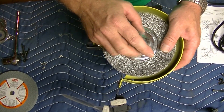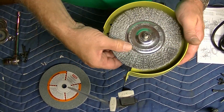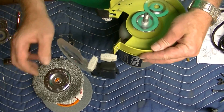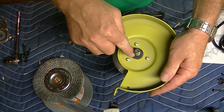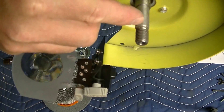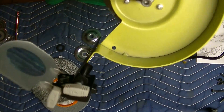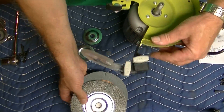So this comes off — we attached it earlier. We took the grindstone off of course, and as you can see this is the body. This is much thinner than the grindstone of course. Ryobi gives you a spacer to go on before the flange, right here, because of that shoulder. That means the nut that tightens everything down does not go down further than the shoulder. So to make up for the loss of thickness of these two attachments, you have that spacer.